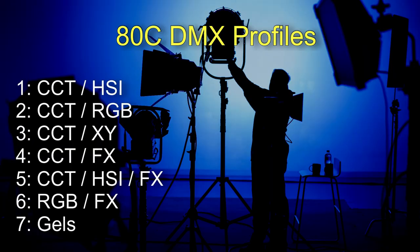The DMX on the ATC sounds impressive on paper — it has CCT-HSI, CCT-RGB, and a CCT-XY profile. But these are not crossover profiles. In the CCT-HSI profile, for example, you can have CCT mode or HSI mode, but you can't simultaneously select a CCT, a plus/minus green value, and mix a colour in the way more complex lights allow. In the HSI mode, desaturation goes to one fixed white point — you can't select a Kelvin or plus/minus green target. At $350 that's not necessarily a deal-breaker, but that fixed white point is quite green and really needs recalibrating.